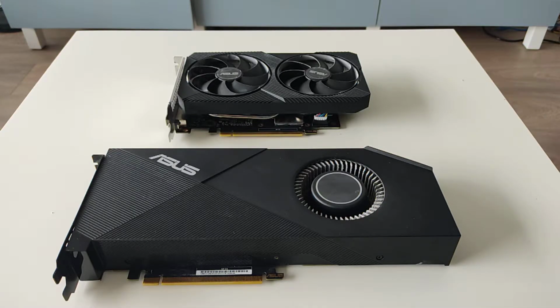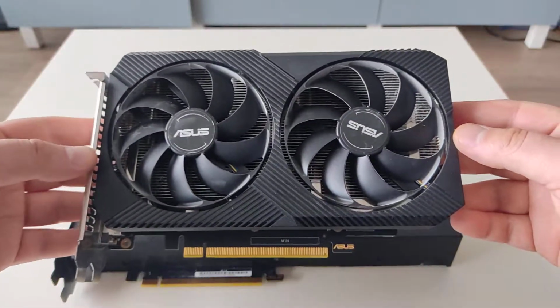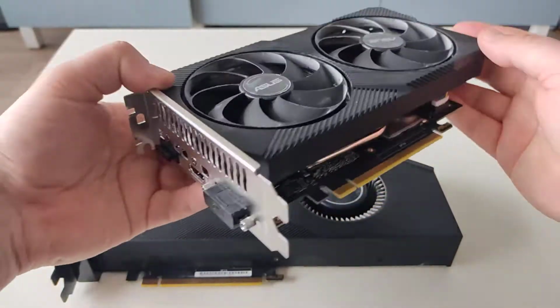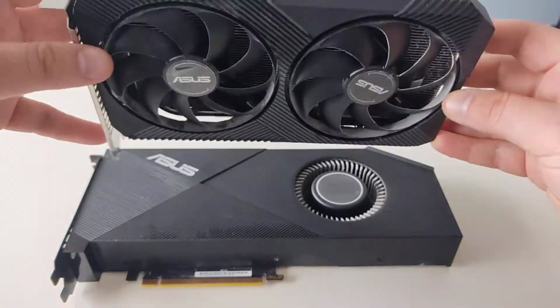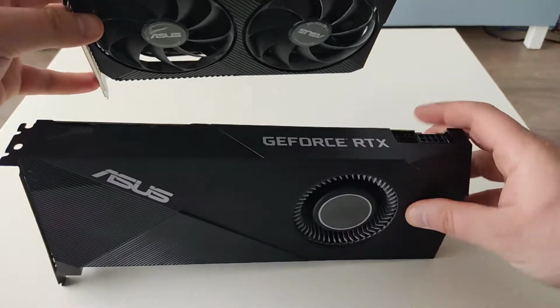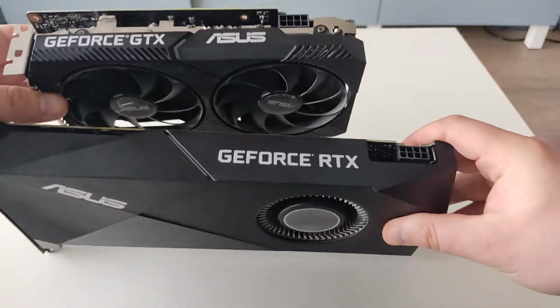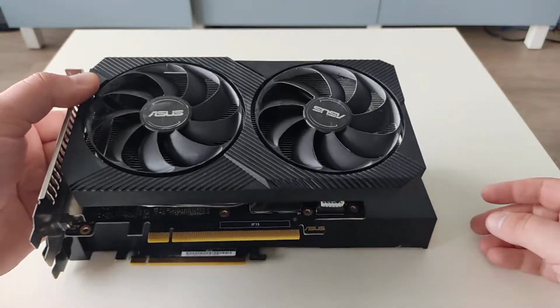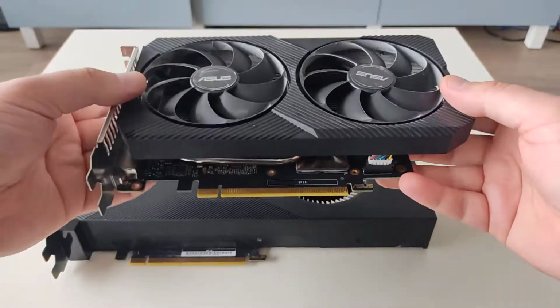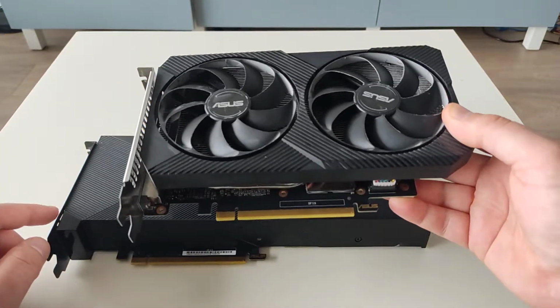If you never saw the unboxing for the GTX 1660 Super made by Asus, I will put a link down in the description. I made it a couple of months ago. This is a pretty nice card. Both of them have these 8-pin connectors. They require relatively the same amount of energy. So either you have a 1660 or an RTX 2060, you don't need more than a 550 watt power supply.